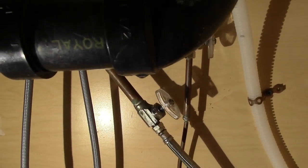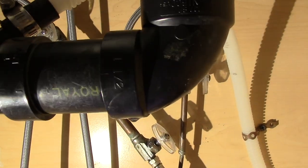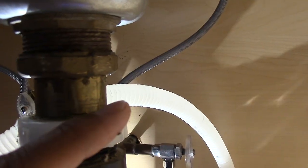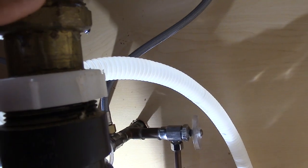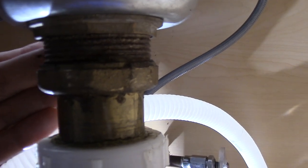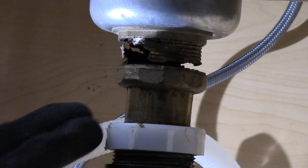It's true, we have a leak — we've got some dripping going on around here. And here's the problem right here, I can see where the dripping starts. The leak is between this threaded area and the drain extension. So I went to twist the pipe and it broke right off — it had rusted through.